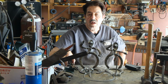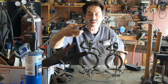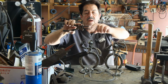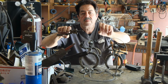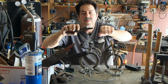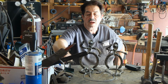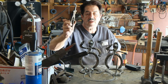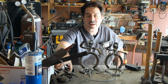Now, I would tell you, get yourself MIG pliers. This is what I call them. You have wire cutters here. You have another piece here that'll hold that MIG tip, do the same thing that we just talked about. It's got a little bit of knurling in here where you can grab a nut or something and loosen it. But if that shield on your MIG gun gets all corroded with slag and all that stuff, you take the shield off, you slide this into it and twist it like this, and all that comes off, and it's clean. It's part of the prep work before you start welding, and this makes it fast and easy to do. So these 2 tools are very inexpensive for you to get and have.